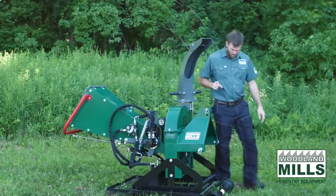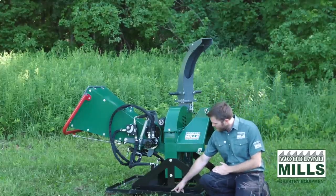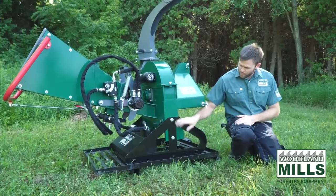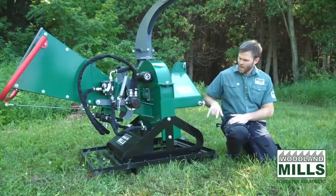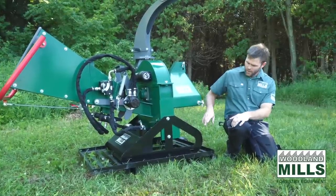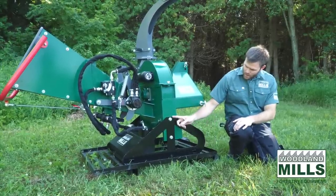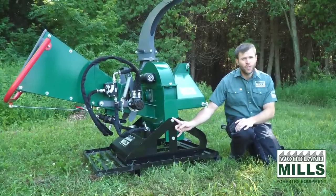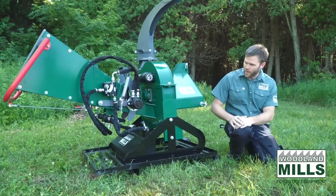Next, I'll show how we get our last few inches, and that's done here with these bolts. So when the chipper comes on the crate, these bolts are gonna line up with the lower two holes, and then you'll be able to back your tractor into the three-point hitch, lift the chipper off the crate, loosen these bolts, drop down the legs, and replace them in the upper position. And that's how we get the chipper at its final height and get it up out of the shipping crate